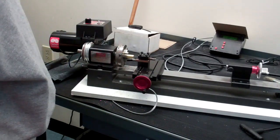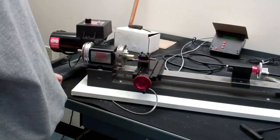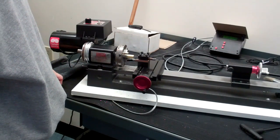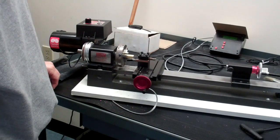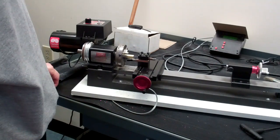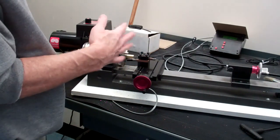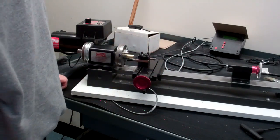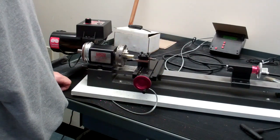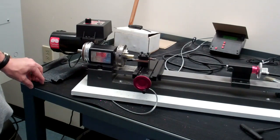This is a half-inch diameter. Let's say I wanted to take that half-inch diameter down to — say my drawing says I need four hundred thousandths diameter — so I'm going from five hundred thousandths to four hundred thousandths. One thing about turning is that since the part's rotating, if you're turning the diameter down with your right-hand tool, your diameter is going to be reduced twice as much as your depth of cut.